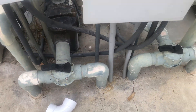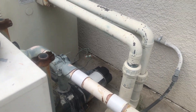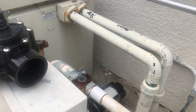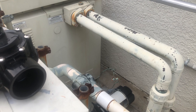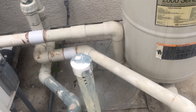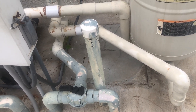The other thing I'm doing is addressing the heater plumbing. The way they plumbed this, the heater flow is constant through the system. If you know anything about these heaters, there are a lot of restrictions inside them — so why run water through the heater whenever the pump is on when you don't need the heater? I'm going to plumb in a heater bypass valve with a check valve so I can completely bypass the heater when it's not needed.